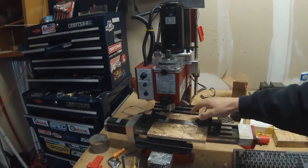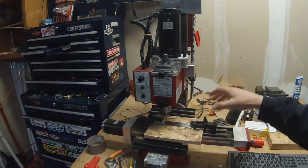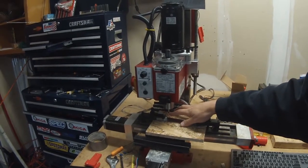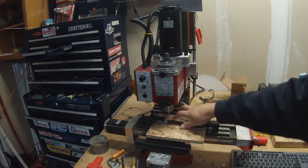Hope nothing bad happens and let's have a good time. Right now I've got everything zeroed out, the machine's home, and I've got the machine thinking that it's touching the corner of it. So it's raised up maybe a little less than an inch. I'm gonna run it like that, make sure it looks good, and then if that all looks good, we're gonna go ahead and do some engraving.